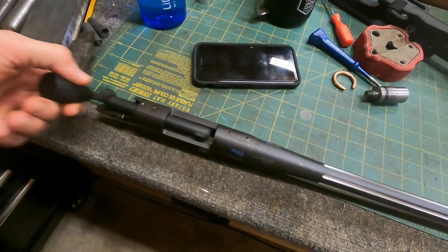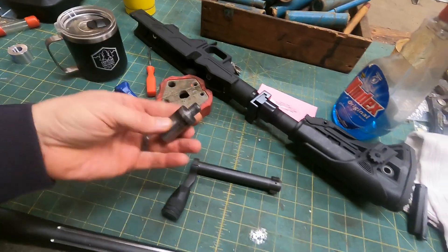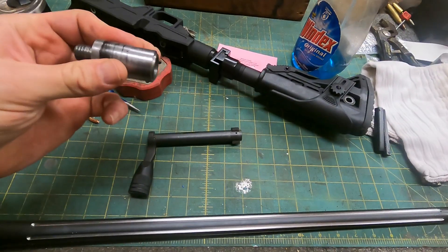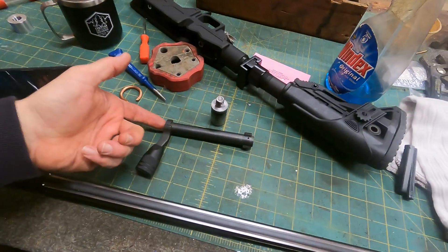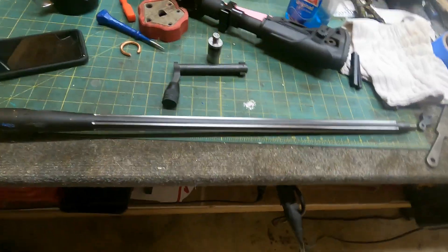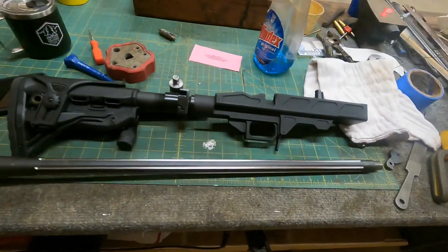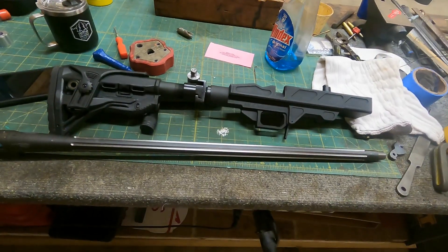I'm going to do the bolt another day, probably tomorrow. This is a stub that I turned so I can hold the bolt in my chuck on my dividing head and turn it concentrically. I had to hold the bolt in a four-jaw chuck and take some skin passes to get it running concentric — we were about 40 thousandths out of concentricity from the threads to the center axis of the bolt, which is pretty significant. We still need to mount it in this stock that the owner provided, and I still need to flute the bolt, then we'll be Cerakoting it in flat dark earth.